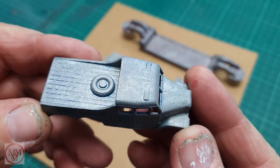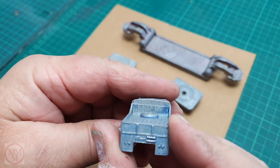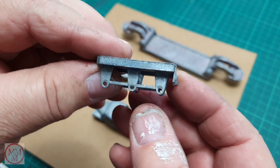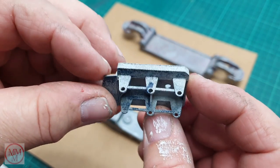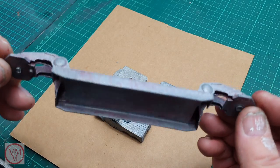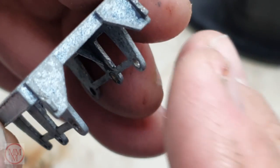Not only that — the paint stripper gets 100% of the paint off more often than not. But with this sandblasting technique and looking through the frosted glass window, it's difficult to gauge how well you've done. It's only afterwards when you shut down and bring the stuff inside under good light and high magnification that you can see the sandblaster has actually left some of the original paint on the model. It's also altered the surface finish of the metal, giving it a kind of very minor pitting all over — making it look dull. I'm going to look for some other stuff like maybe walnut shells and see if that does a better job. But in the meantime I'm sticking with this because it's done now.